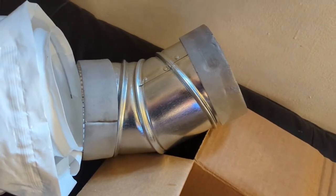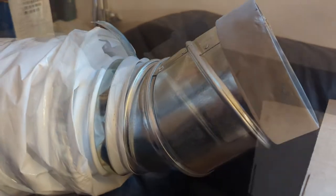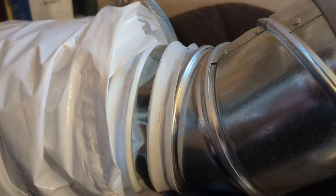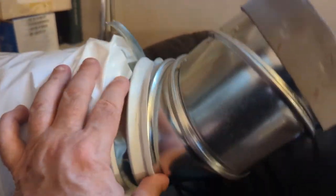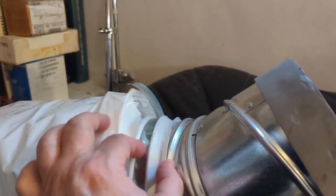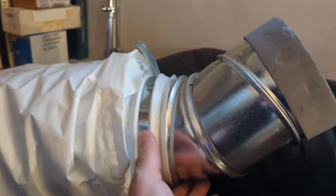Be careful. The insulation is taped on both ends of this duct. Here you can see one end of the duct is inserted in the hose and clamped down. Insulation is between the duct and the hose to make a basically tight fit, but it is slippery with the hose and the insulation, so you tighten it down as best as you can. You can see the window part of the hose is installed into the boot by the window.